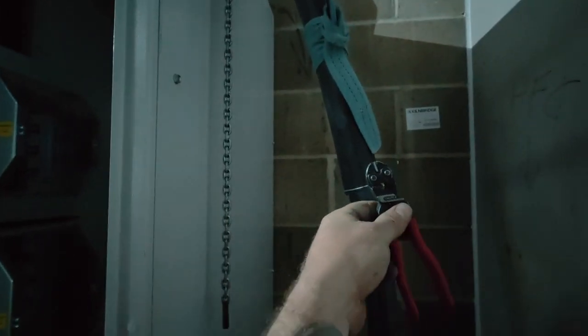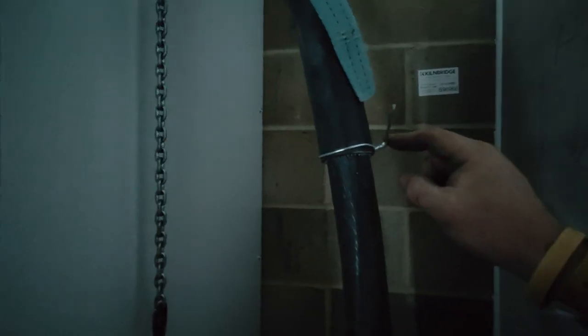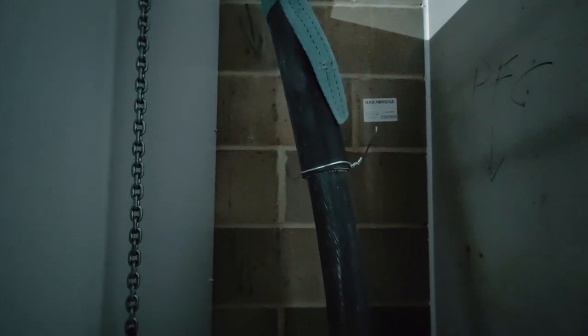Right, so what's done there, obviously, stripped it, unwound the armouring, and then I cut them about there. I cut them all the way around using those little bolt croppers from Knipex, really good they are. I used them, not forgetting to tie on a piece of armouring to keep the PVC tight to stop the fish hooks. And now basically I'm going to fit the gland.